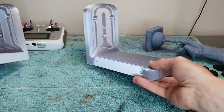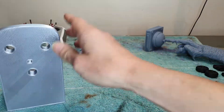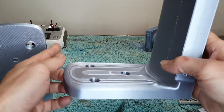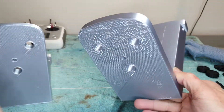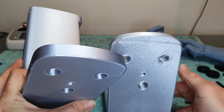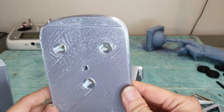These printed out great — I've done two of them. At this point I hadn't really leveled the bed properly, so on the first one, printed with the flat side down, you can clearly see there's an issue around this corner area — it was a little bit low. I just tightened that up a little bit, pushed it up a couple of turns, and I ended up getting a much better result. I think I still need to move it up a tad more because I've got a little bit of a lip — it's not as sharp as the back sides — but that was the only thing I could really pick on it.